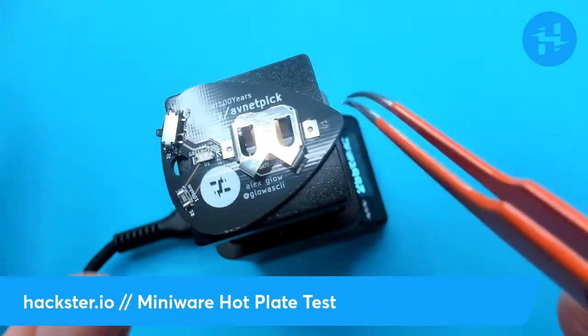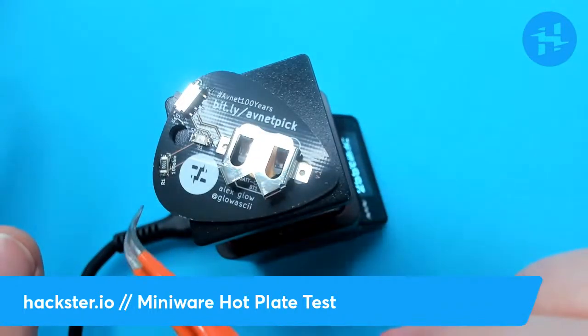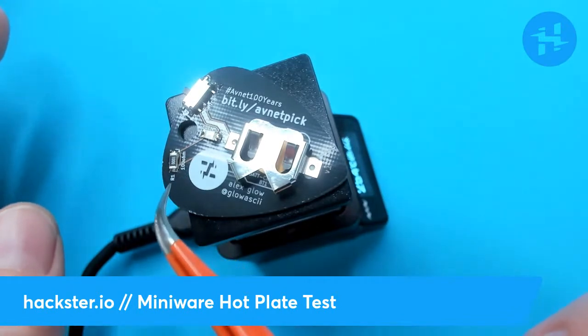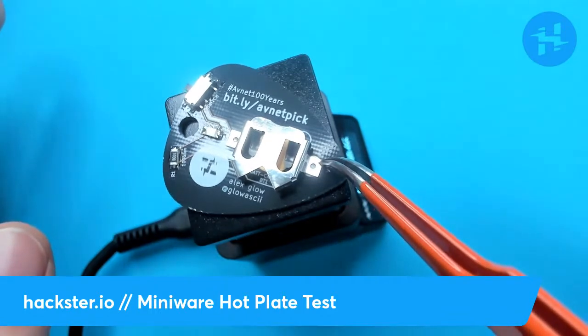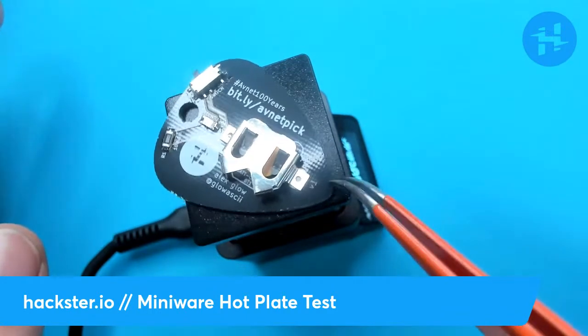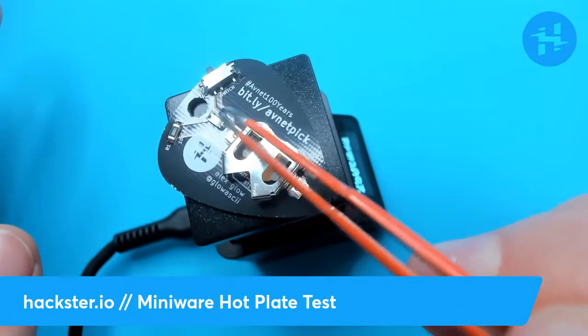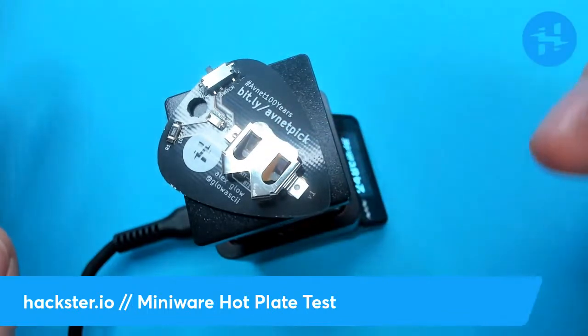Sometimes you will have the hot plate hold at a temperature that is below the melting point of the solder. Oh, look at it — it's going! There we are! It's about 243 now, so it probably started around 240. Oh, that's so cool! So exciting! Do you see that? I'm going to nudge this so that it doesn't bridge that contact. Oh my gosh! Beautiful! The stuff on this side of the board has gone — you can see that it's all shiny now. This is still kind of a paste on this side. I kind of wonder if there are any hot spots on here.